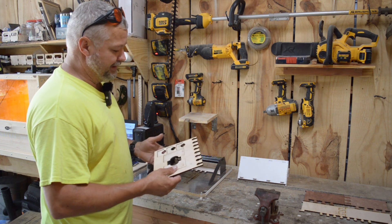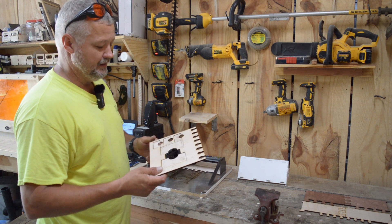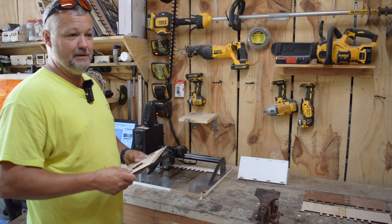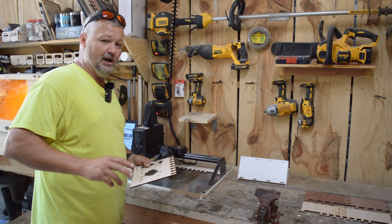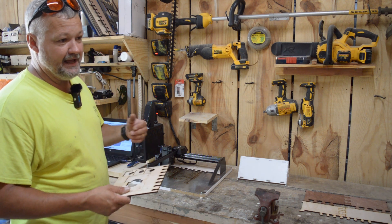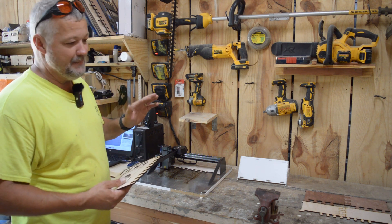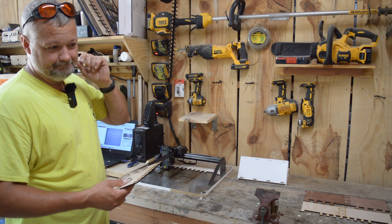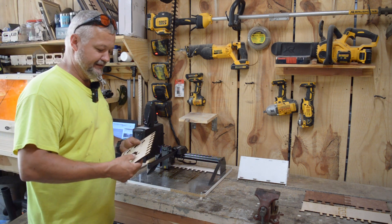What I would recommend if you're going to get this machine — don't be trying to do heavy lifting as far as really thick material with cutting. But for engraving, it has very, very clear engraving. It does a really good job with coated metals; it has enough power to remove the coating and reveal the metal underneath. I don't have a rotary for it so I can't do tumblers, but I've done dog tags and anodized business cards and it's doing a really good job. It has really fine detail — it rivals my D1, and it may even be a little more precise as far as resolution.